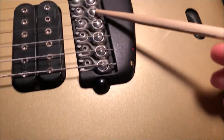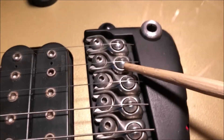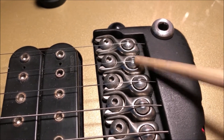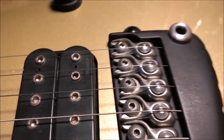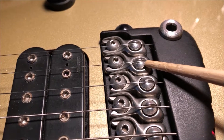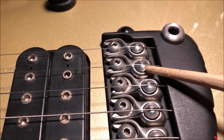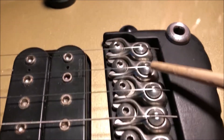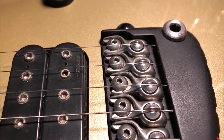I've concluded that the super glue between the two pieces of the piezo element is actually acting like an insulator, preventing the electrical signal from the vibration of the cap from being transmitted to the rest of the system. So I think what I'm going to have to do is pull this back off, clean off the super glue, and then find some sort of conductive something to attach this cap back to the piezo element underneath it.